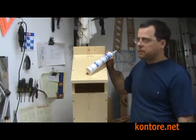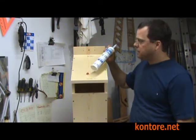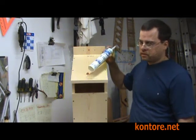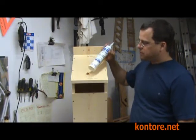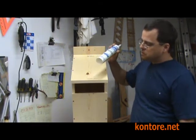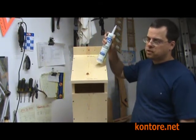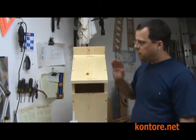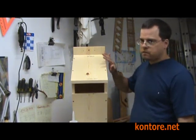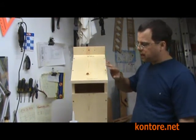You're probably wondering when am I going to apply the silicone to the roof. Well there's a reason why I've delayed — it's because you can't paint over silicone and you can't stain over silicone. It'll screw up your work. So what you need to do before any of that is the unit has to be stained or painted first. Stain or paint your owl box first, and once it is completely dried you'll apply the silicone.